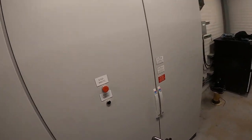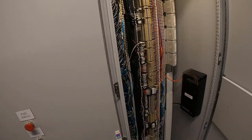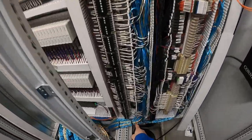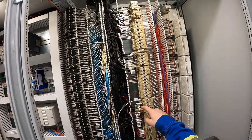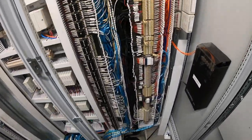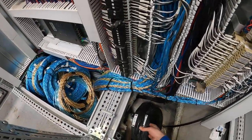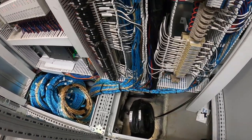Here it is — this one here is for motor control throughout the facility, and this is where we have our DCS controlling devices throughout the facility. We've got a bunch of analog inputs, some outputs down below, a bunch of discrete inputs and outputs. We've got to tie into some of these spares here to get some control feedback from that VFD and PLC out there. We also have some discrete outputs which control some actions out in that building. Down here we've got to take some wires from here — this goes through a junction box out in the field.